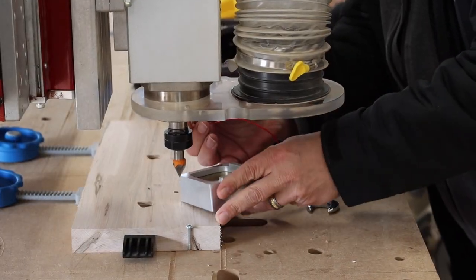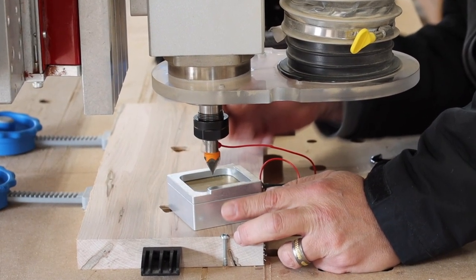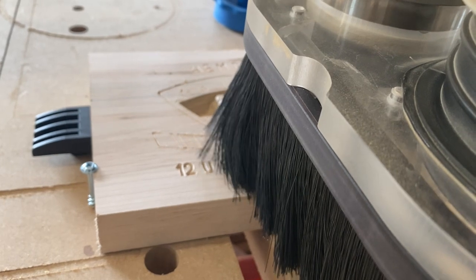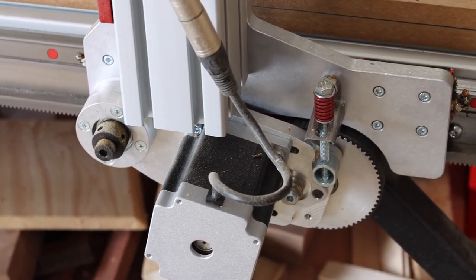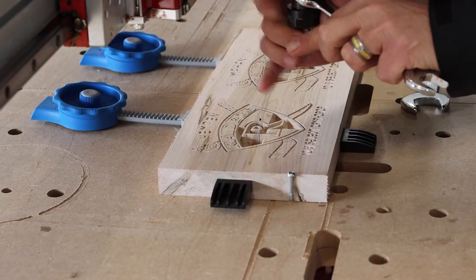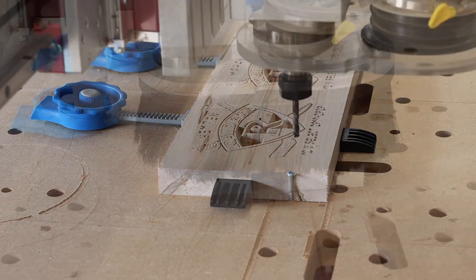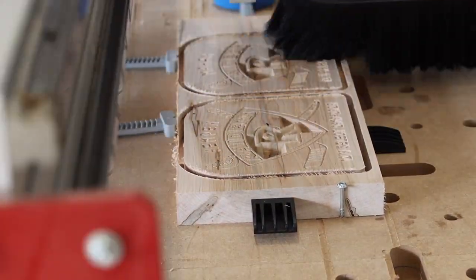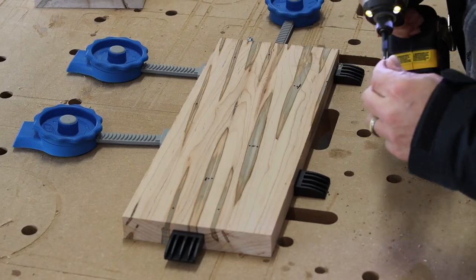Here I make a simple mistake — I'm going to zero out this v-bit far too close to the left edge of the stock, and in doing so I'm assuming that my stock is perfectly flat. I either made a mistake zeroing my Z somehow, or this particular piece of stock was a few thousandths thinner on the right and the top than it was at that bottom left corner. To fix this I re-ran the v-carve operation with Z set to about five thousandths lower, and after that second pass the carve came out fine. Then I switched back to that same down-cut quarter-inch bit for the profile pass. From here it was a bit of a rinse and repeat for the third and fourth plaques.